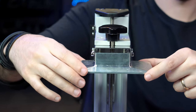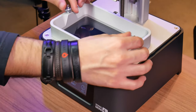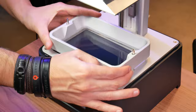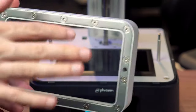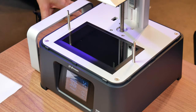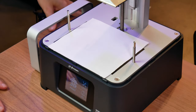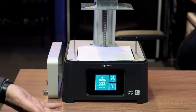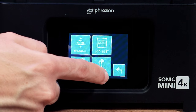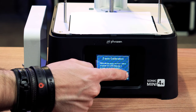Now it is much easier to move the build plate. The next step is to remove the vat — just be careful not to damage the FEP film. Now I'll take a regular sheet of paper cut to fit the area and place it on top of the LCD screen. We use this to level the build plate without touching the screen. With the printer already on, we can see the menu on the front screen. In the Sonic Mini 4K, to start the process I'll click Tools, then Z-Calibration, and Next. The build plate is now moving down. Make sure that you have loosened the screws, otherwise you can damage your printer.